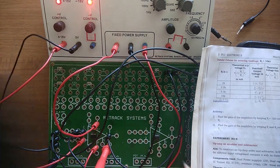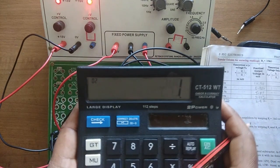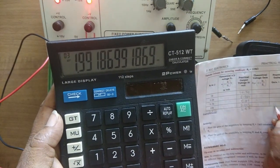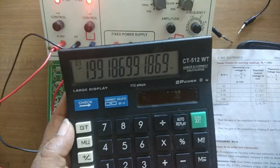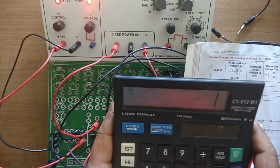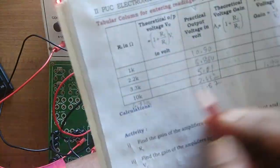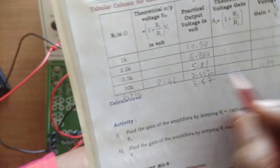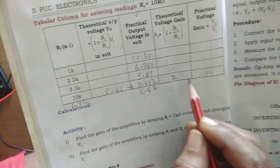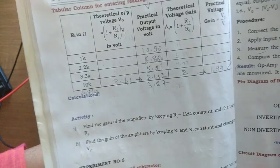For 10kΩ I got 2.45 as output voltage and the input was 1.23 volts, giving a practical gain of about 1.99, almost 2. The theoretical gain is 1 + (RF/R1) = 1 + (10k/10k) = 1 + 1 = 2, so the theoretical output is 2 × 1.23 = 2.46. I calculated 2.46 and measured 2.45 — these tally. Similarly the other readings also tally, and thus the experiment is verified.